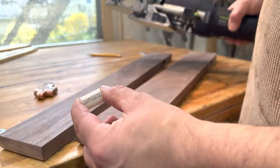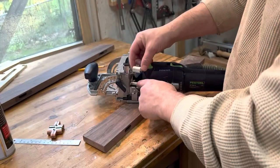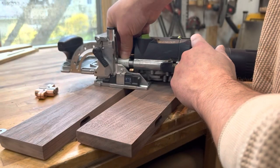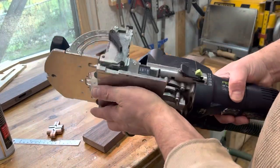I'm going to use this piece that I created out of PEX. It has a groove in the back that fits over the depth slide on the Festool Domino. This will make sure that I don't go too deep for the wings of the hinge.